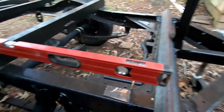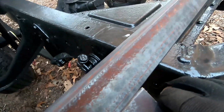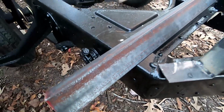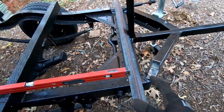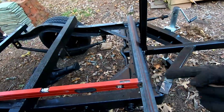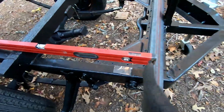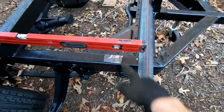So I am going to weld this bracket to it flush, like so. I don't want it back behind it like the other one, because I'm going to put bolt holes through here and run bolts through it to attach the front bed piece, because otherwise there's nothing holding the front bed piece at the bottom. So it's being held on the sides by this bedside, but I want to secure that bottom bit. So we're going to use bolts through it this way to do so. So now just going to get this set up right here where we want it, and then go ahead and get this piece held up, marked, and get these cut.